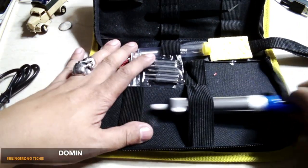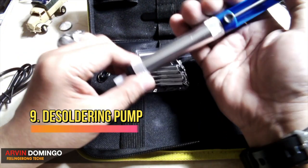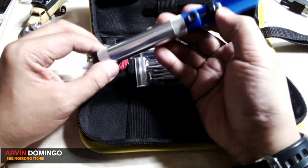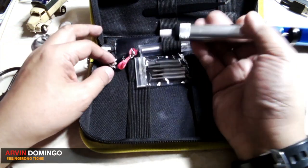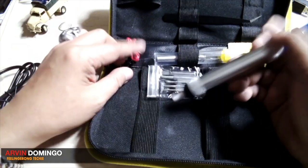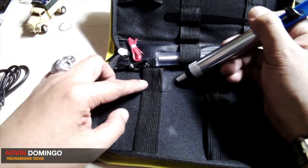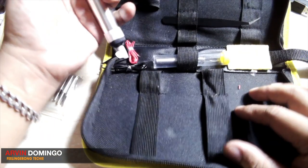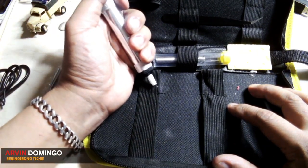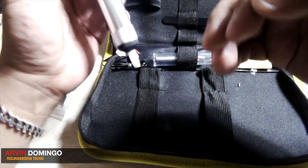When you're doing some soldering work, you also need to remove solder blobs. So this is a desoldering pump. All you have to do is press this part right here, and it will do a suction when you press it. If you need to remove some solder, press this black button right here — and it will suck it right up. As long as the solder blob is still hot and in liquid form.